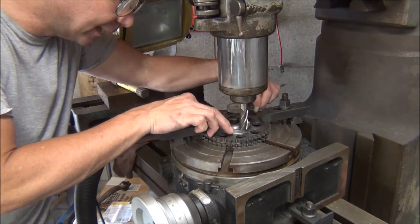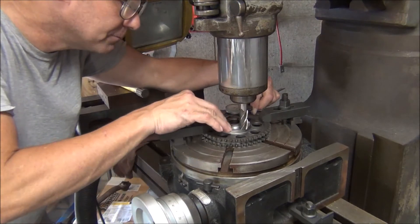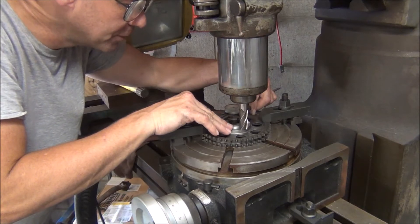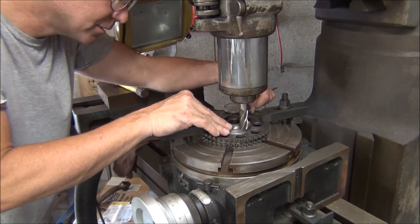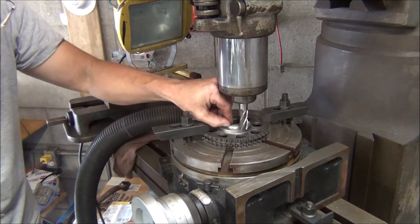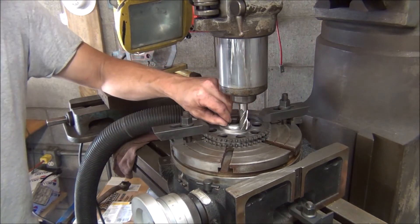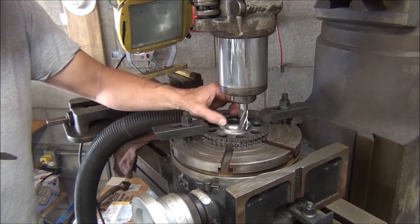The surface I cut — I'm getting, trying to get this thing down on here flat, a little bit awkward especially with everything in the way and not wanting to be in the way of the camera. I'm getting one inch 538, and the original surface I need to take it down to is one inch 500 — nice even number. This surface right here I'm getting ready to cut, I'm just going to blend it into the same diameter as the original by moving it in, not down. That surface is not that critical — if I was out a thousandth or two, which I am not, it wouldn't matter, because all it does is slide inside of the Torrington bearing.